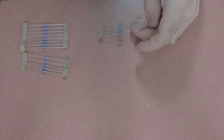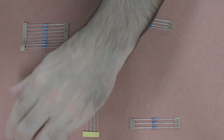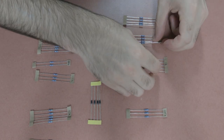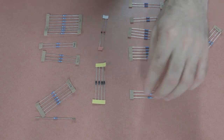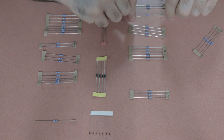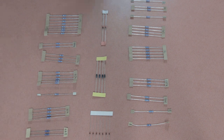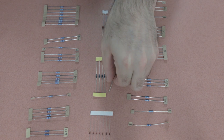I like to place my components out in a nice neat chronological order — you can see I've labeled the various resistors, checked them, and written in their resistance. That's important to make the job a lot smoother and quicker when you're finding and inserting components. It's one less thing to think about. The last thing you want to be doing is checking resistance as you're inserting components; it makes the whole process a lot quicker and easier.